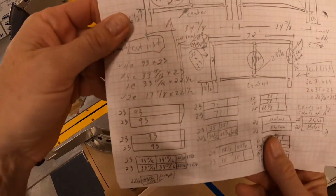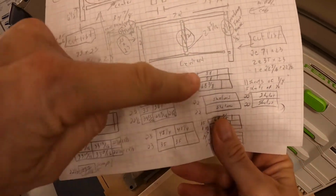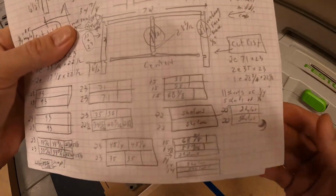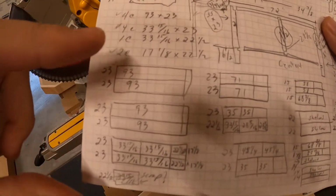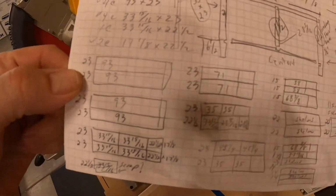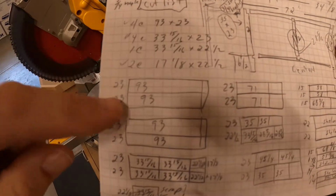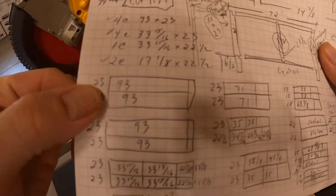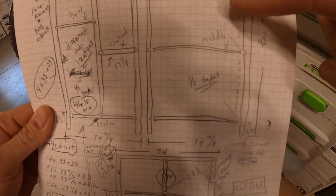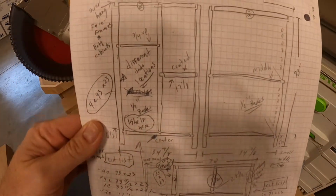I need a total of 11 sheets of 3/4 pre-finished maple plywood for this job. So I start a little strong, at 23. I'll be at 23 1/4 roughly for the first, and then I'll rip off the edges. These are going to need to have holes drilled in them, dados put in for all the joinery, typical stuff.